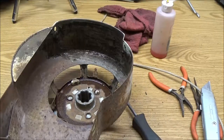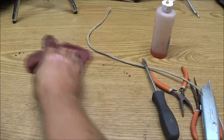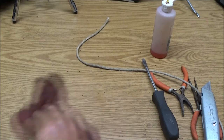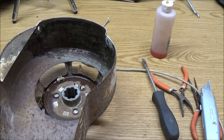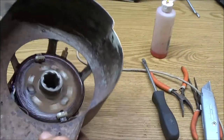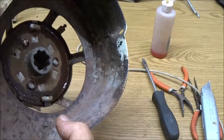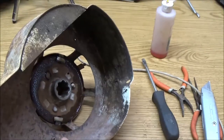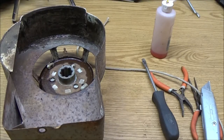We're going to put it back on the edger — not in this video. This is just how to restring this thing, and it's the same process if you're putting in a new spring — just add that step. Make sure you get it wound so it winds counterclockwise. See — when you pull that it turns counterclockwise, and when you release it turns clockwise. That's all you've got to remember. There you go guys, thanks for watching — I appreciate it. Shea Bear, The Minute Man Legend, gone for now. Bye bye guys!